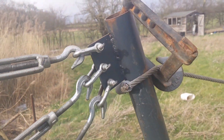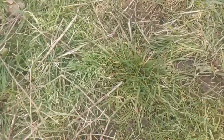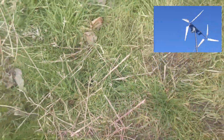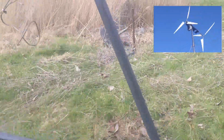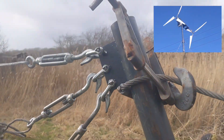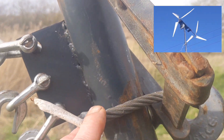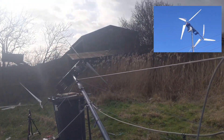So I just want to explain what happened there. Because I don't have a hook in the floor here, the gin pole is at too much of an angle — it should be coming out approximately 90 degrees. It still works fine, but what had happened is: what I was using to hold that on had busted, and that had just immediately flown down there and let everything off.